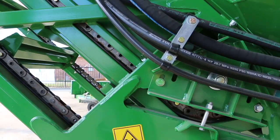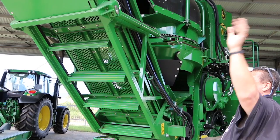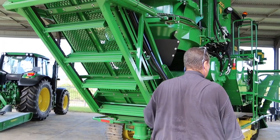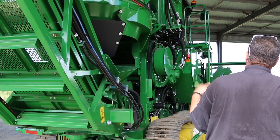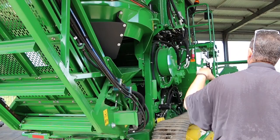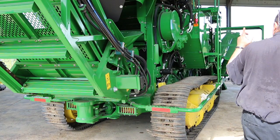Your slew — your motor up there drives your main hood around. There's also another motor up there that runs your bin flap and your secondary hood adjuster. They have also added another pump or motor up there for the coolers. We did have an issue a couple of years running where the hydraulic oil was overheating, but they've fixed that issue now and it seems to be working quite well.